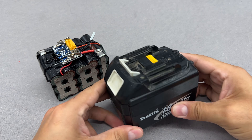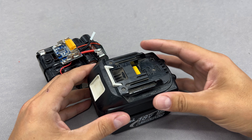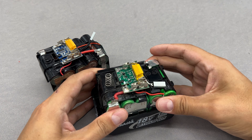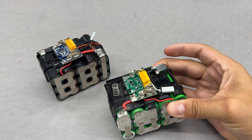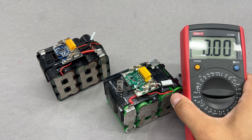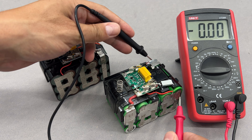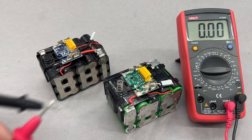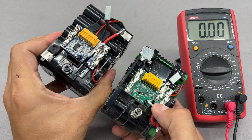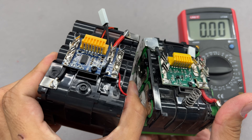This is my repaired and extended capacity Makita 18V battery which I built two years ago. It has a protection circuit inside with the same design, combining old 18650 cells from two Makita batteries. All those two years, this battery was often used without any issues. Let's check the state of balance of each cell group — they are perfectly balanced. So if a battery pack made from used cells could stay in balance, I see no reason why a battery assembled from new cells would act differently.